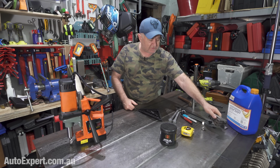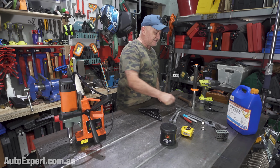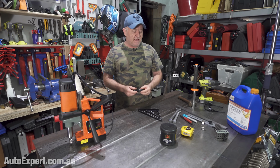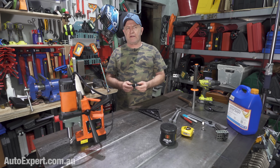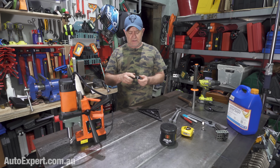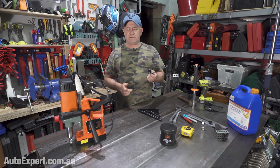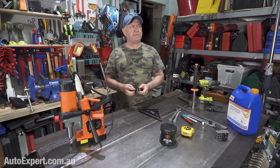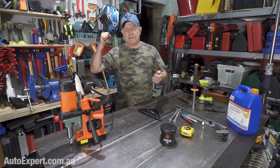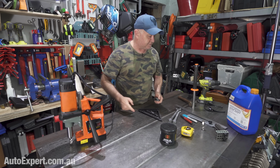The jig thing, we've covered that off. Now, what else can we talk about? Oh yeah, the fasteners. Now, this is kind of interesting. Once you've got the fasteners in the right spot, you've got to think about torquing them down. So I looked up the torque specification for class 10.9 M16 fasteners. It's 270 Newton meters. Now, I want this to be easy to pull apart into the future, and I also wanted to reduce the manual effort because you're lying on your back and you don't have a great deal of mechanical advantage when you're doing up these centralized bolts in particular.